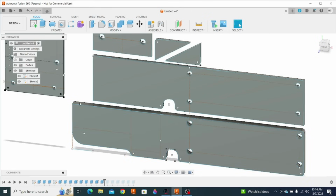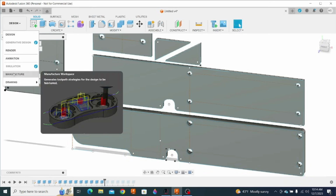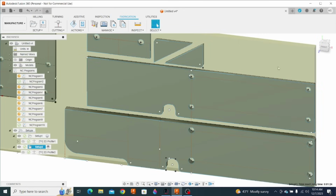All we need is the face profile, so it doesn't matter the thickness. I think the thickness is addressed by parameters in the setup file, which is handled under the manufacturer tab. So the setup is set to 1/4 inch. We'll change the cut speed in fire control software.